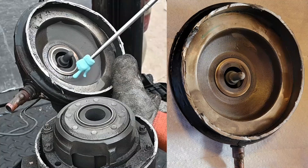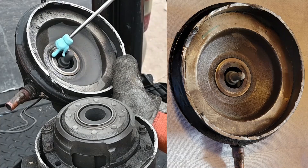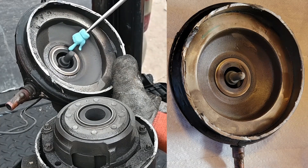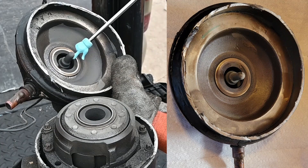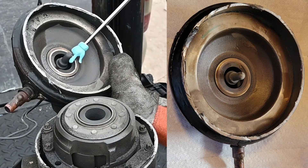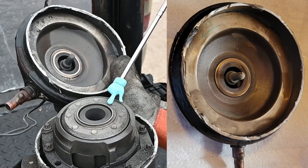This is the bottom of the muffler plate, and here we can see a little bit of a ring. That's where this floating seal pushes up to make a seal against the bottom of that muffler plate. There is a bit of a groove in there, but it's really not bad at all. We can see all of this carbon built up right here on the top — that's a sign of compressor overheat, running with low suction pressure, running low on refrigerant, or a high compression ratio. We also see signs of overheat with all this carbon built up.